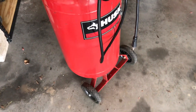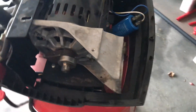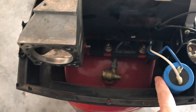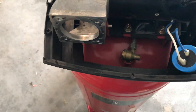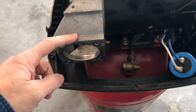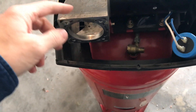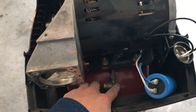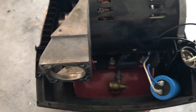I think it was put away with pressure in it. A couple things were wrong. First, these are the fenders — I took them off for access. There's a hose that goes from the crankcase — effectively where the piston of the motor is — to the inlet on the tank, and it had just popped off. Let me show you what we've got going on.